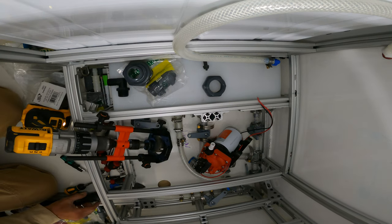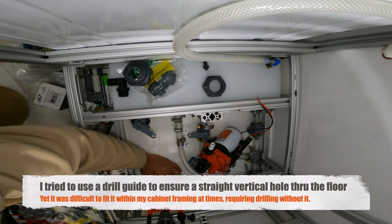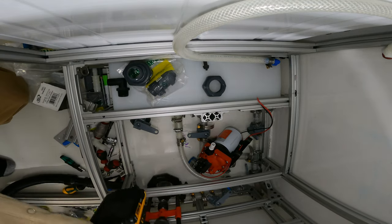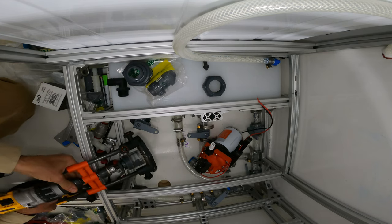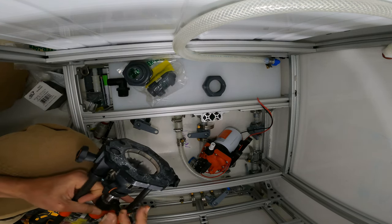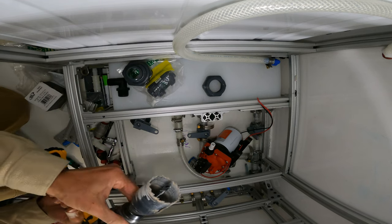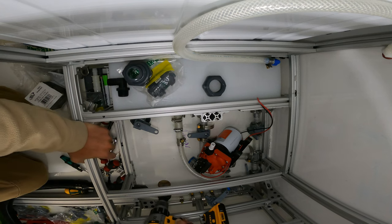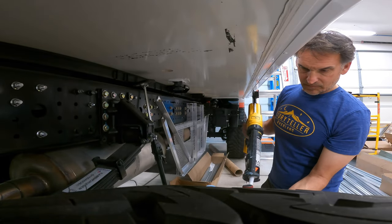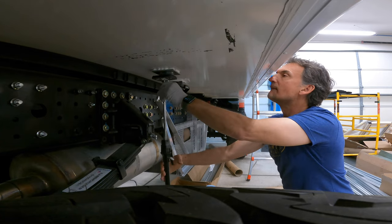Clean up the sawdust and get back in here — make sure you get a nice straight hole going through to the bottom. It turns out this drill guide doesn't allow enough throat length to cut all the way through this three-and-a-quarter-inch deep panel, so I had to transfer the hole saw straight to the drill and just drill manually. I've got to turn the saw to fit between my existing framing and get it to the depth. To assure it's fully watertight all the way through, I use a Sikaflex sealant with the right consistency — between a liquid and a paste — to really flow into these spaces and seal them up without making a mess.